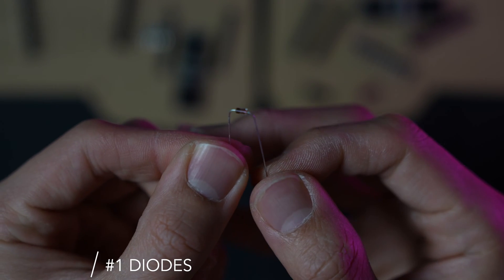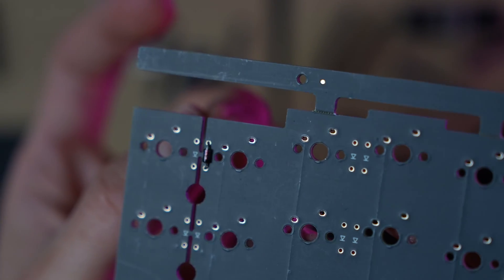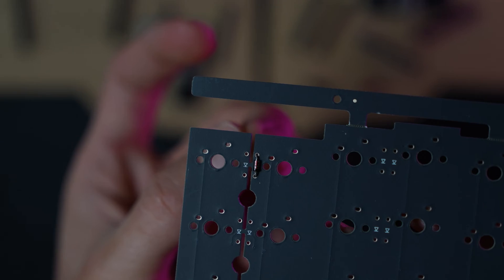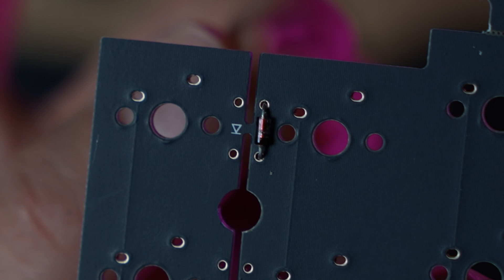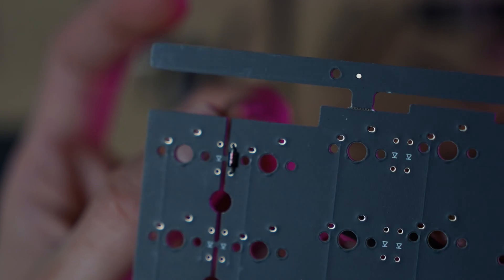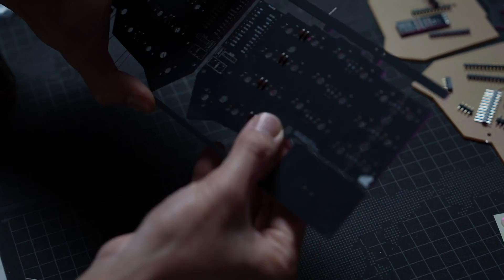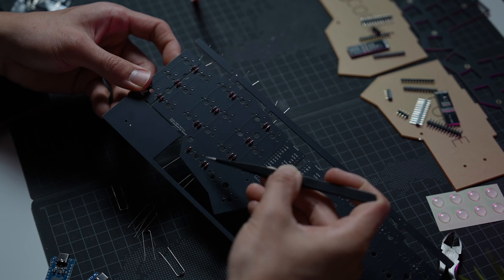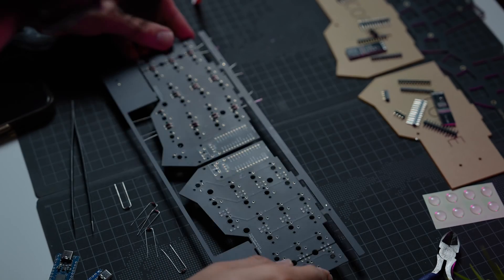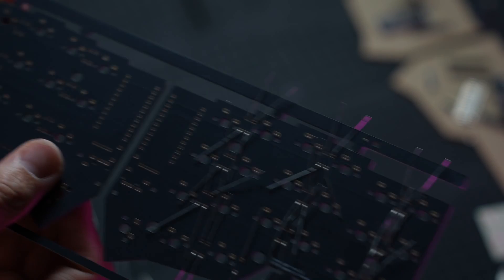The first thing we'll be doing is soldering all the through-hole diodes onto the PCB. It is a tedious job as you will need to bend the legs of the diodes and carefully align the correct orientation when inserting them into the PCB. The diode has a symbol that shows which direction it is to be mounted. The darker part of the diode follows the direction of where the arrow is pointing. The upper side of the PCB is the side with the diode symbol showing on that surface. There are approximately 21 pieces of diode on each side, so do take your time. The diode legs coming out from behind the PCB should hold the diodes in place even without soldering.